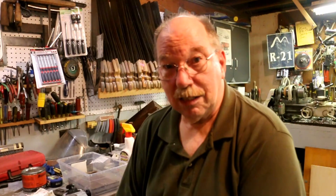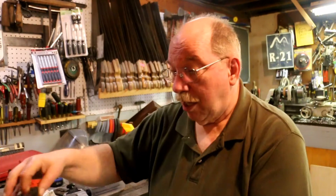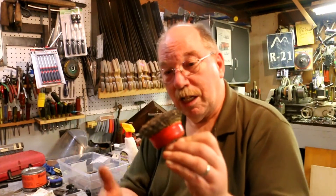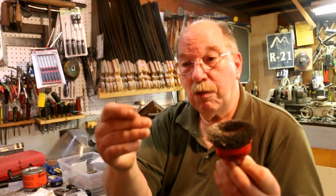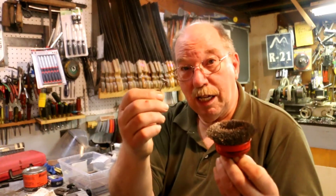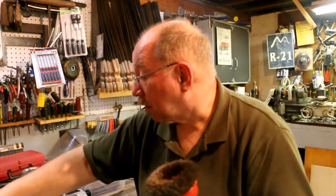The natural tendency is just to push harder. Why? Because it works — it's not a good thing to do, but it's what happens when people are faced with a situation where they need to get a job done. So they just push harder. Consider this wire wheel with this nice big wire being pressed into doing the same amount of work that this little guy did, to the point where this one starts shedding wires like this old boy.